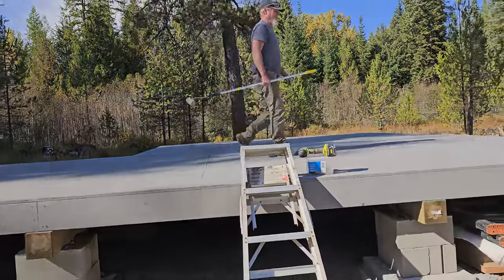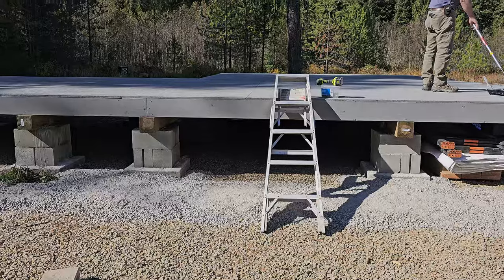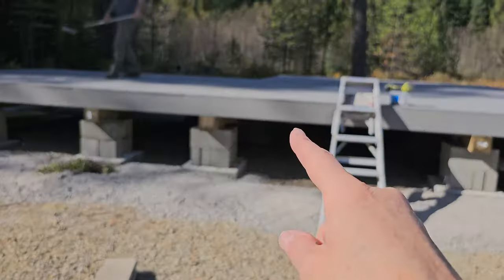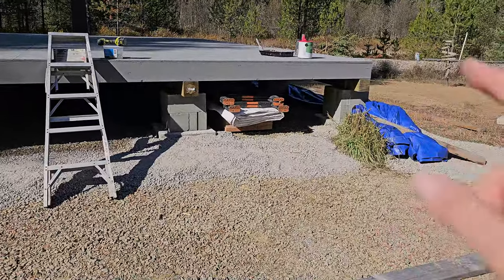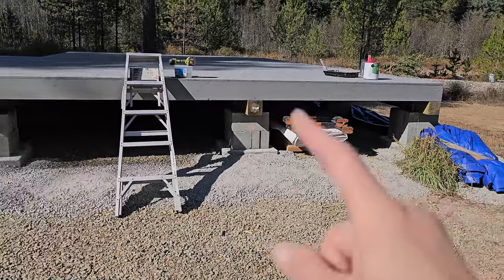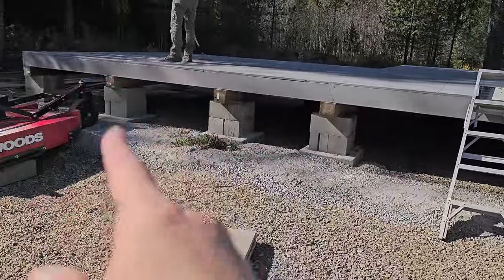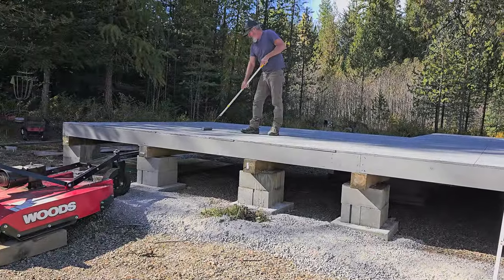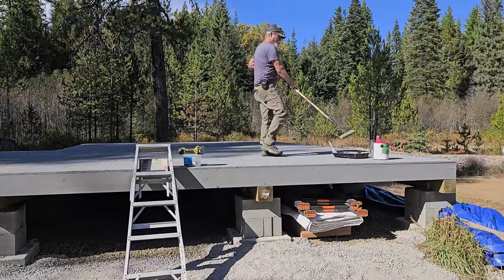Just to recap what we've done to get ready for the cabin: we brought in road cloth, which you can see the end of right there — there's road cloth all in here. There is three-quarter minus gravel; we brought in a compactor and compacted it all. We poured footer forms, put in cinder block piers, and concreted all the corners all the way around. We put in anchor straps so we can screw the beams to the pier to anchor them. We built the floor — the joists are made out of 2x8s. These beams are about 8 feet apart. The joists are screwed to the beams, it's decked, painted with exterior paint, and caulked. We're going to tarp it with a 50x30 tarp for the winter, then come back in the spring to pick up where we left off.